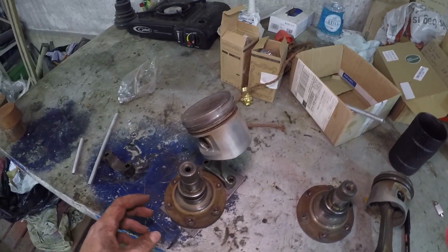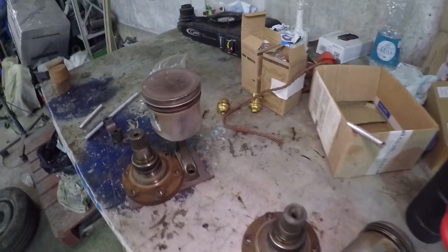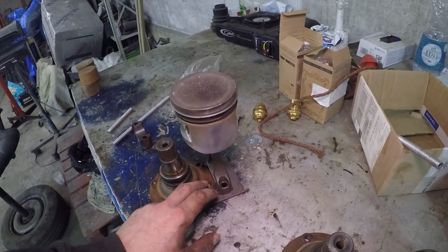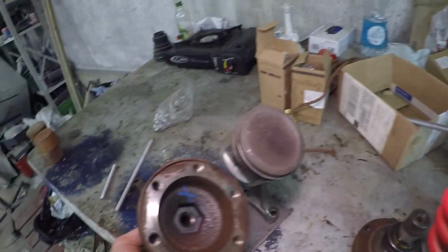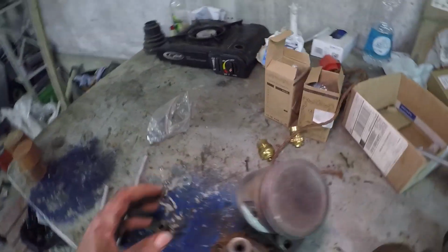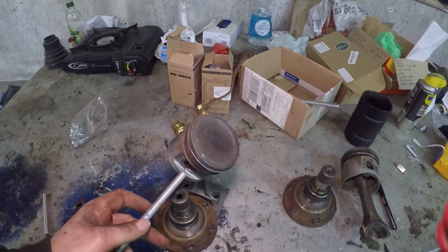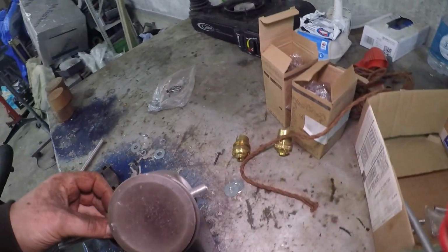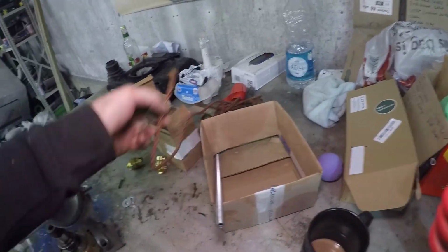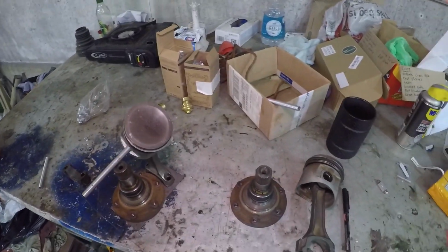Got a driveshaft cup, something simple. I don't want it to be too big either in there, because they're not like a main feature. So the idea is just to weld the piston to the top. Cable will sit in the back of there, perfect, that's what we want. Loads of fixing holes, perfect. And then essentially, like I've done my other lights you guys wouldn't have seen, 10mm all thread goes through the piston, lamp holder sits on top, bolts through there, and then braided flex out into the base. So really simple.